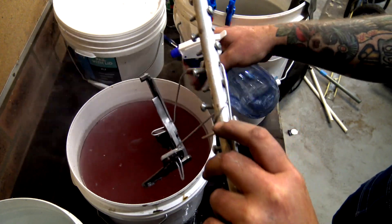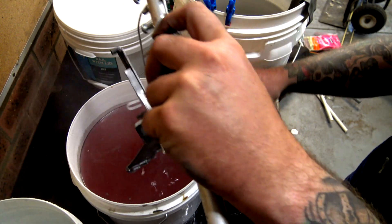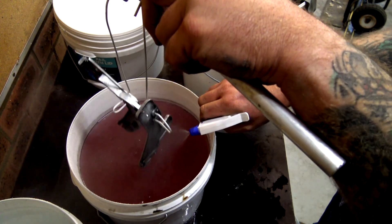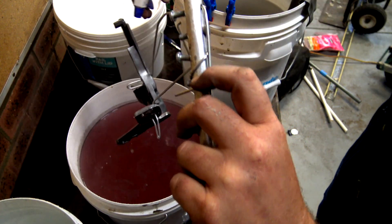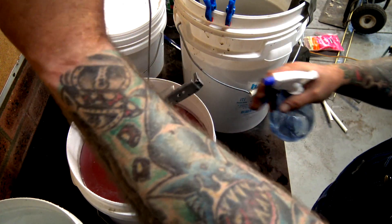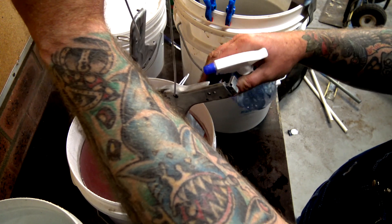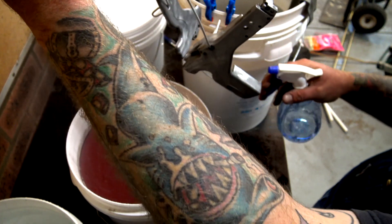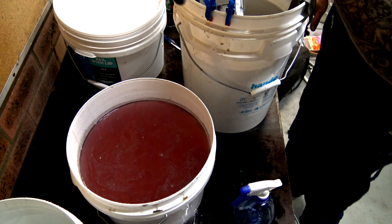After each step, when I pull it out of something, I give it a full rinse. I've got a spray bottle of distilled water that I keep handy, and I use this to rinse off everything between every step — whether it goes from the soap washing step to the acid etching step, to putting it in the acid for the electrolysis, to taking it out of that acid, into the dye, out of the dye. Every single step, I rinse it with distilled water. Throughout this video you'll see a lot of wet table — that's the distilled water I've been spraying everywhere.